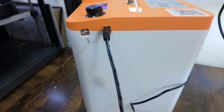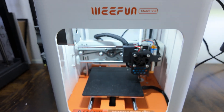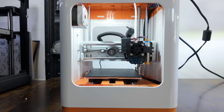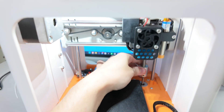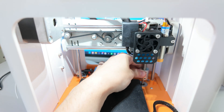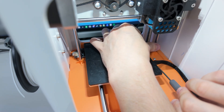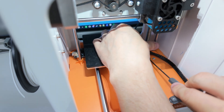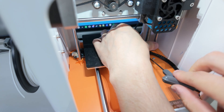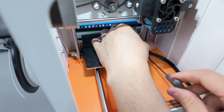It has a USB port, SD card port, and Wi-Fi built in. You can use their app, their version of Cura, or their profiles. I got this printer secondhand, so it was partially set up — the Z-axis rod had come loose. All I had to do was tighten the grub screw at the bottom; it went right back into place, obviously just rattled loose in the box.